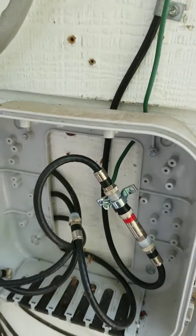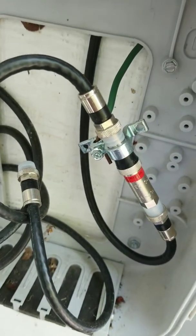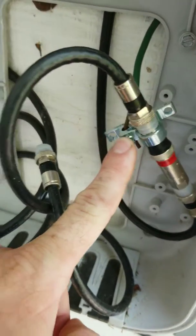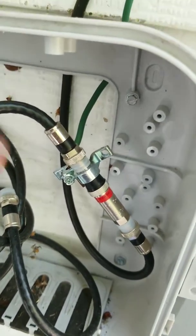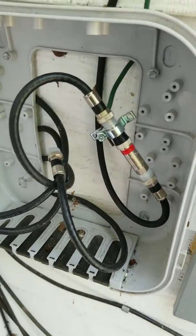If you walk outside and you don't have a wire hooked to something similar to this and you don't have a grounding block — some systems ground to the splitter itself, which has a little screw similar to this, and some systems have that and some don't — you must have a ground line. Must be grounded at the box, to a ground rod sticking out of the ground, or a bridge.